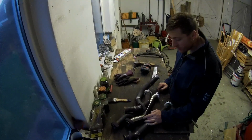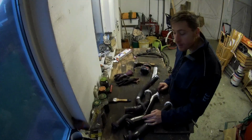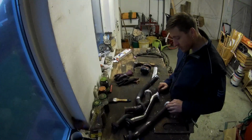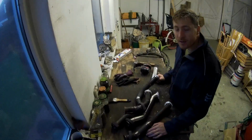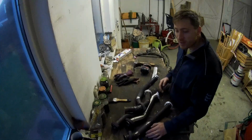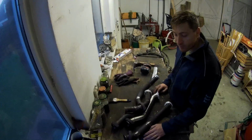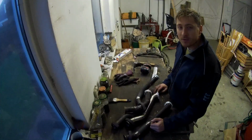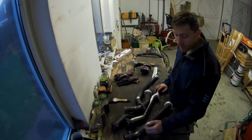The perfect way to weld an exhaust is, of course, I don't do this every day, that the best way is to start in the front, of course, and then weld everything through, so you don't have any metal deformations. Like if you weld stainless steel, it can be deformed a little bit, so there's a little bit of tension on some pipes, so I want to change that. And if you start in the front and then build it backwards, there's less of that, because you modify the exhaust the way that it fits.